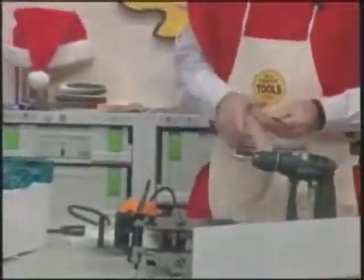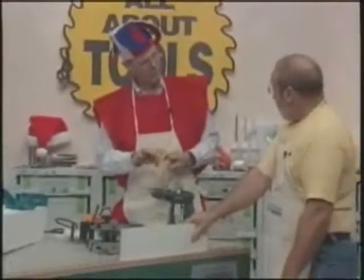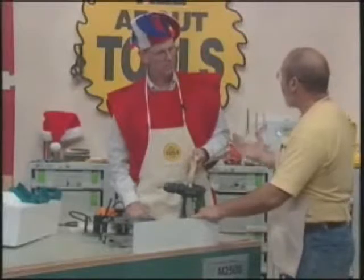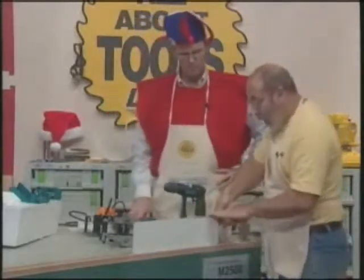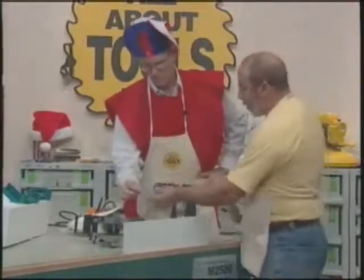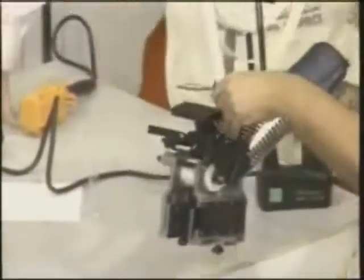Wood can heat through the wood face to the glue? Yes, that's why we sell irons — a lot of people use regular irons, though they don't work as well. What you can actually do is lay the material on the edge of the board, iron it on, and you're heating through the face and melting the glue on the backside. You can't do that with PVC because the PVC will melt. So whenever you're doing a PVC job, you've got to make sure your bander is capable of handling that.